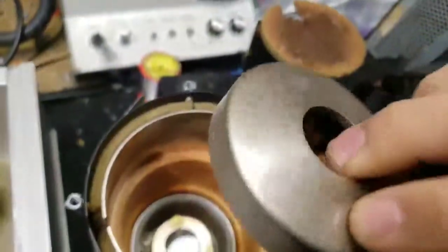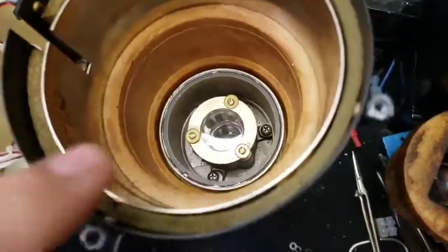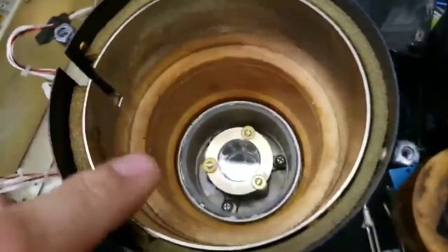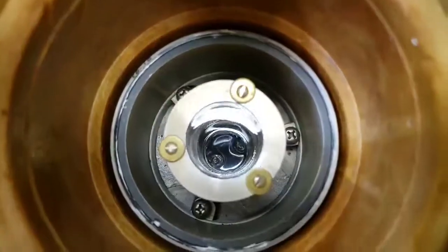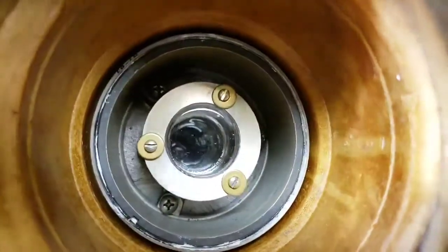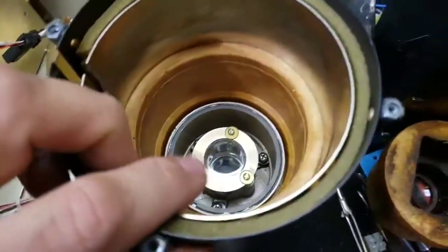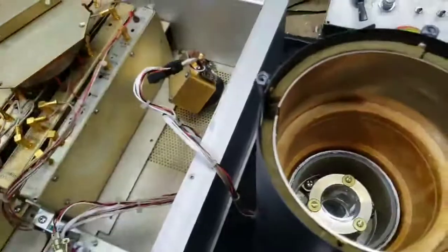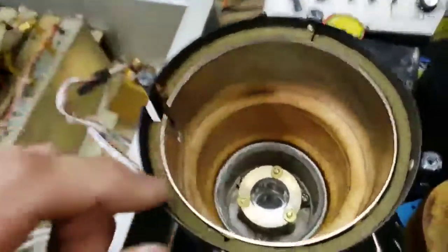There's the metal shield — again, everything is magnetically shielded. The entire chamber, everything, because it is sensitive to magnetic fields. There is also a magnetic field coil, which I'll explain in a moment. Down at the bottom there are two rubidium chambers end to end: one is a frequency filter chamber, and one is the resonant cavity. By resonant cavity, it means it's set to a multiple of the wavelength of the rubidium lamp — the light goes through into there and bounces around, and you're basically trying to get a standing wave forming.